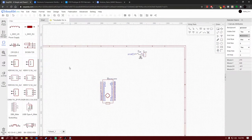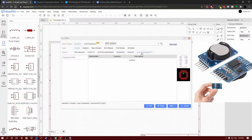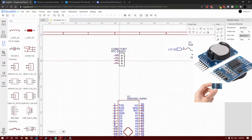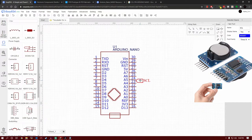Now I'm quickly going to choose the real-time clock and connect it to Arduino. I have a DS3231, but you can use a DS1307 RTC as well since they both use the I2C protocol, though a few changes in the code are necessary. If you can't find your RTC in the library, just choose a four-pin connector since they all need four pins to work. I'm going to connect ground to common ground and use a 5-volt port. I'm going to make a net port and connect it to the SCL and SDA pins of the RTC connector.